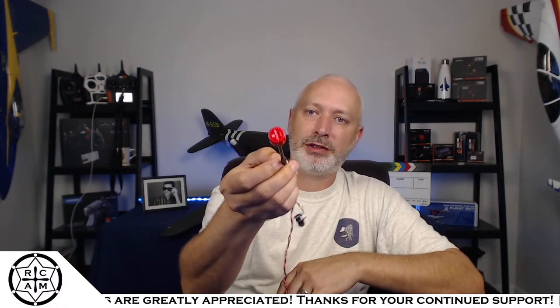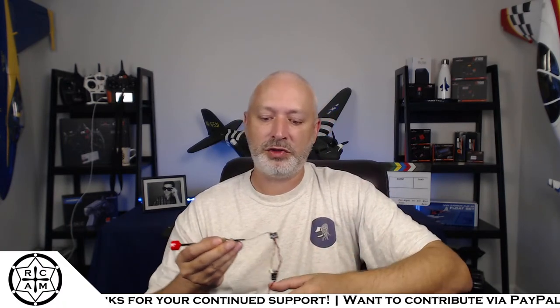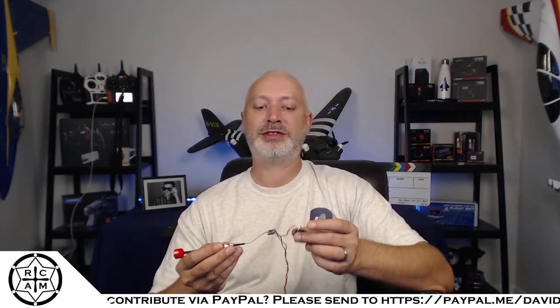I'd rather have a polarized antenna, like you see here, and I can get that up off the surface of the airplane. A lot of those smaller all-in-one units were intended for micro drones, or micro quads. With this one, I can stick this thing anywhere I want, have a separate camera, and get this up and out of the way to get it cooled down. So this is a better scenario for me,